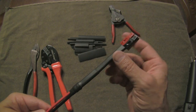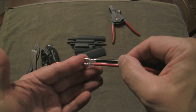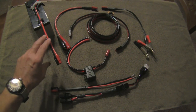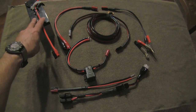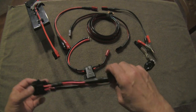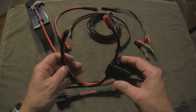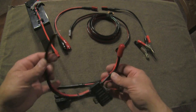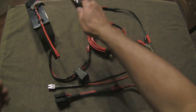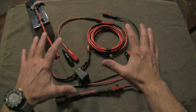There you have it — an Anderson PowerPole with strain relief. In this case I've got two wire ends tinned with solder that will plug into my switching plug-in power supply. This should give you an idea of the flexibility of Anderson PowerPole. So here's a pigtail off the end of my 12-volt battery, an accessory cable made to go into a switching power supply, the power cord to my radio with Anderson PowerPoles and fuses, an Anderson PowerPole connector for an automobile 12-volt battery, a 12-volt extension cord with Anderson PowerPoles on both ends, a set of wire clips, and a set of battery clips. And trust me, this is just scratching the surface.